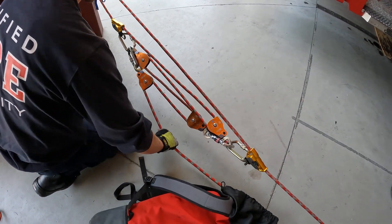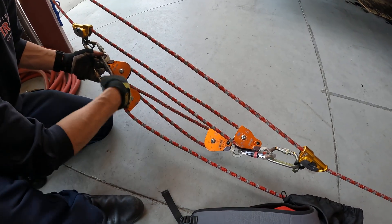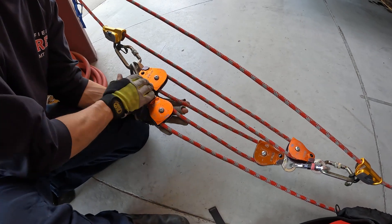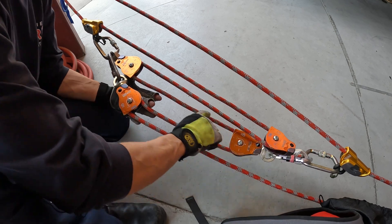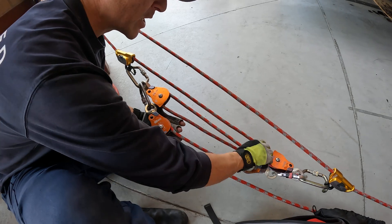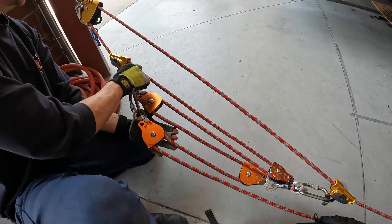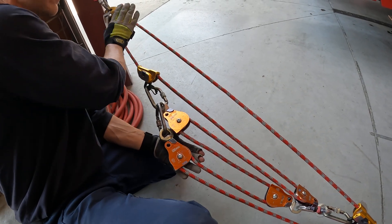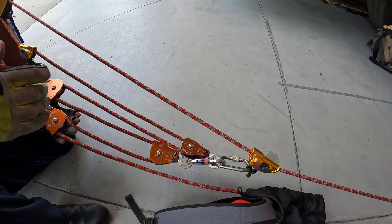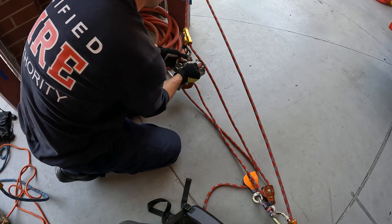In reality if I was doing this for real, I would take the time to rig this correctly with double sheaves. Let's do the T-method: one in, one out — two here; one and one out — two here; one and one out — two more for four. So four here: one and one out — two more for four here. So four and four; one continues in; one plus the four we had is five; five and five out — five plus four is nine. So this is also your nine-to-one inside nine to one, just with rope.